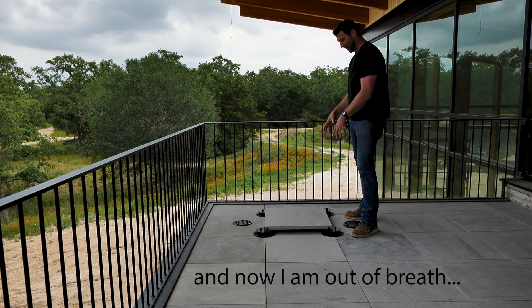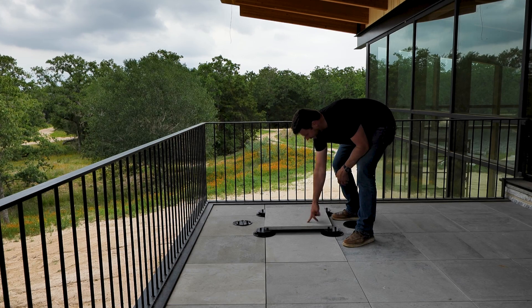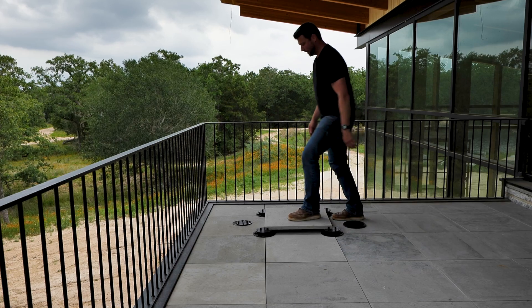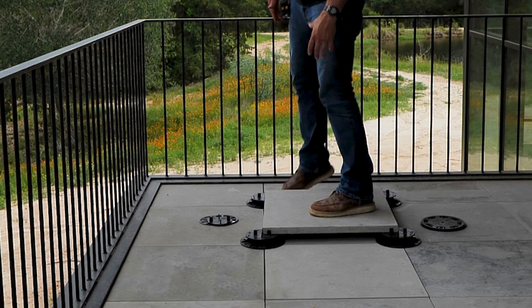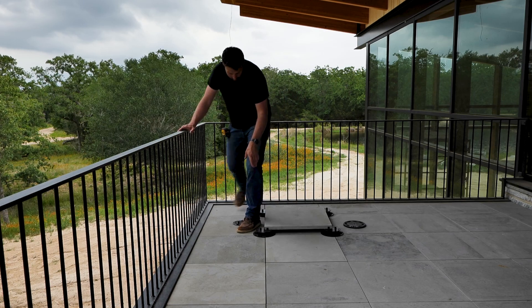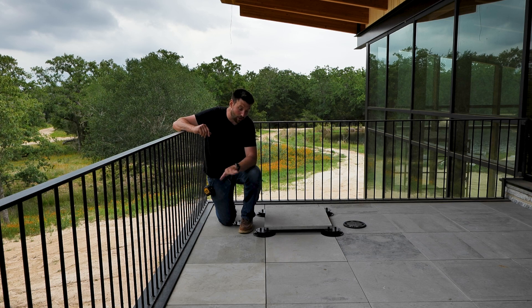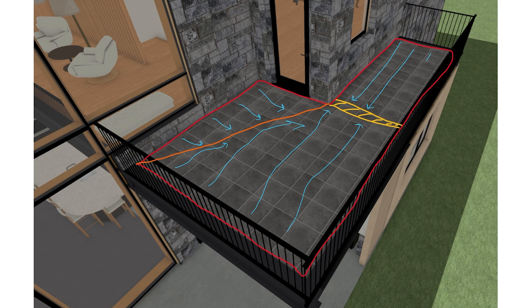It goes on just like that, and you can see we've got a clearance here between our roof and our decking. You can stand on this perfectly fine. Once you get them all adjusted so they're completely flat, you're floating this stone above the roofing below. What's really cool is that all of these cracks between each piece — we're not grouting those, they're just open. So if rain gets in here during a big storm, all that water falls right in between the stone tiles, runs down to the gutter, down through the downspout, into an underground gutter system, and out to the pond beyond.